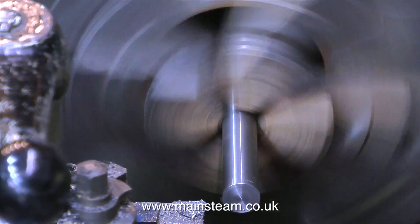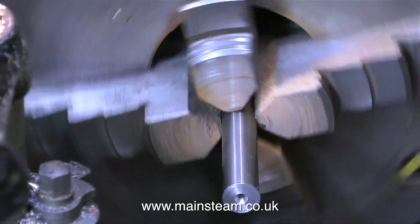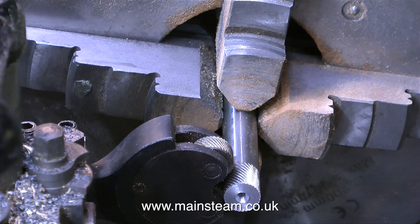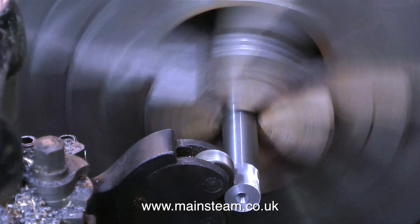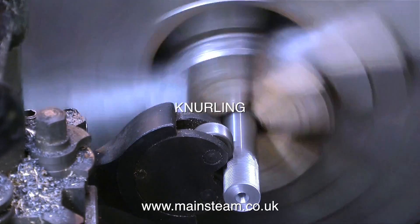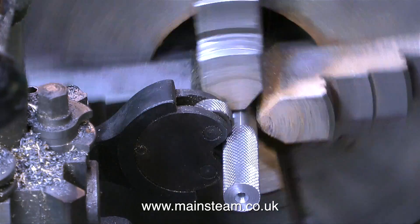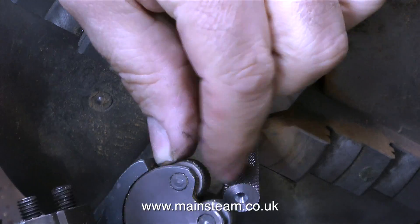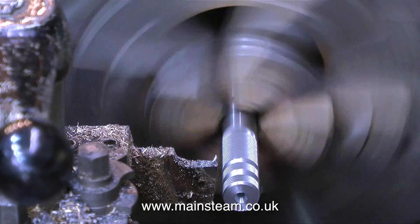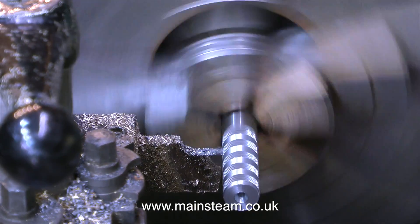What I'm going to do is make four knurled bolts. Normally you would make the bolt in one piece, but I don't want to do that. This is a very simple way of doing it, and it's fairly quick. What I would normally do is put a piece of metal in the chuck, turn it, thread it and part it off after I'd knurled it. Knurling — K-N-U-R-L-I-N-G — makes a mark on the metal that allows you to grip it with your fingers, and it's also good for a friction roller. In this case, all I'm going to do is make some little knurled buttons, which are going to be threaded 4BA down the middle and then countersunk to take a brass 4BA countersunk bolt. Doing it this way is a bit of a cheat — it's not proper engineering, but I've never been an engineer. I keep saying to people, I'm not an engineer, I'm a musician.